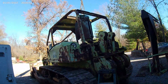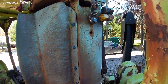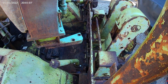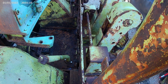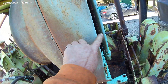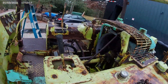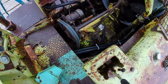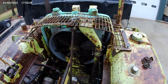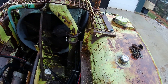Today we're sticking the radiator back in. We pressure tested it yesterday and bolted on the fan shroud. We've got to fish it around that fill tube - or pull the fill tube out - and then try to line up the water neck on the bottom and the water neck on the top. It's a pretty tight fit. You can see we've got the fan pedestal, fan shroud, radiator, hydraulic cooler, hydraulic cooler lines, and vent lines all hooked up now.